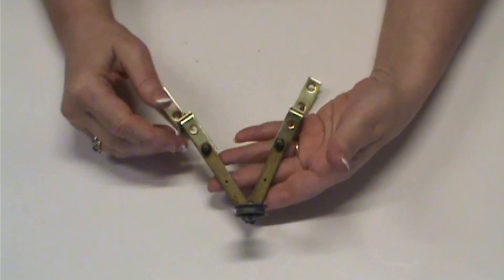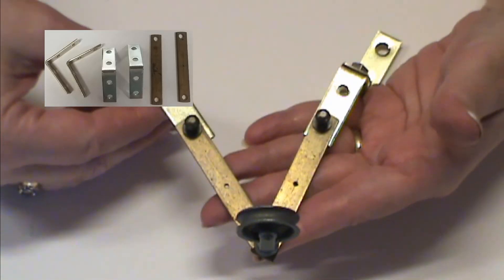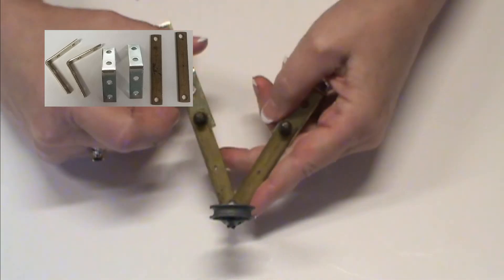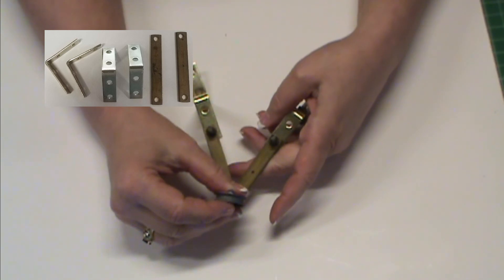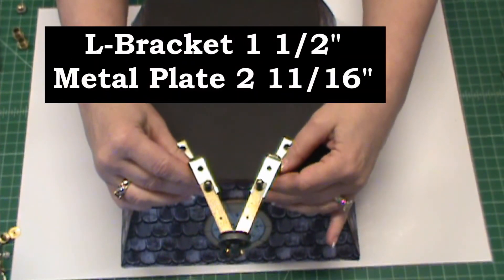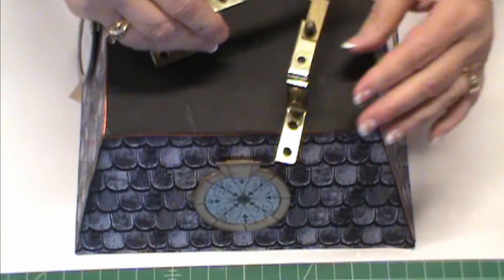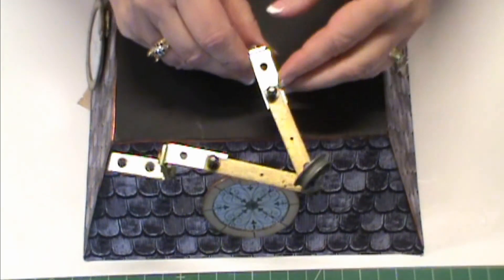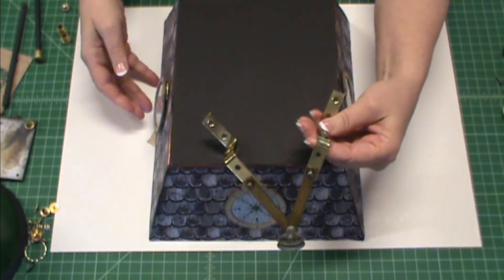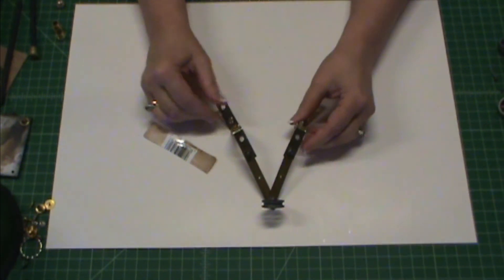This is the mechanism that sits on the roof — here's the pulley I'll use to wrap up the chain and pull the elevator cage up. I made it using two sets of L brackets with two metal plates, and the pulley is attached here. I'll wait until everything is put together to decide exactly where to mount it since I have flexibility using the first hole, the second hole, or both holes. Right now it's just screwed together with odds and ends to confirm the concept works.